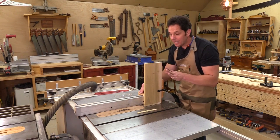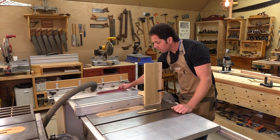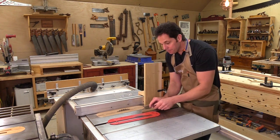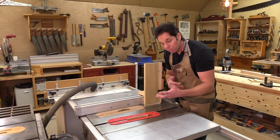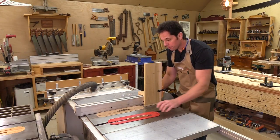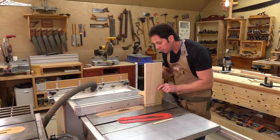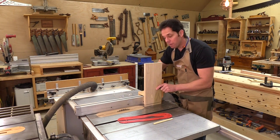A couple of safety notes here. One: I have a zero clearance plate in my table saw. The clearance plate that came originally with the saw — you can see how wide that opening is. This piece could fall down in between there, get into the motor and blade, and cause damage to myself and possibly the machine. At this point I'm going to flip it around — I should be exactly the same if my tenon's in the middle — but just to double-check I'm going to bring it up to the blade and make sure I'm on my mark.